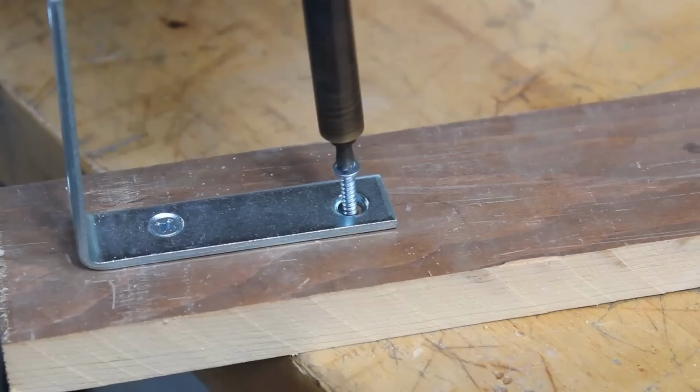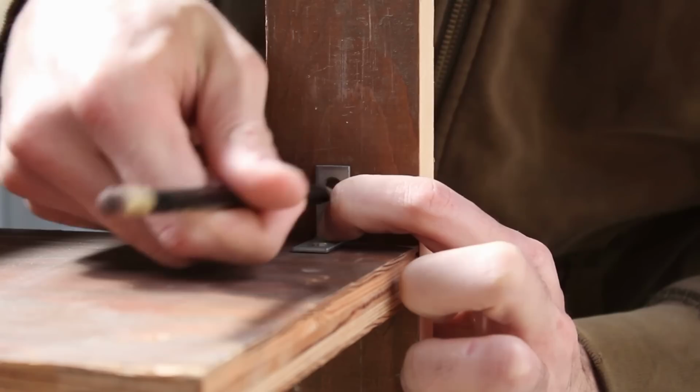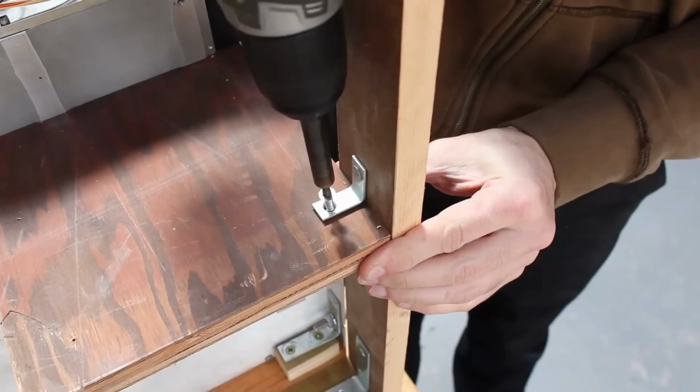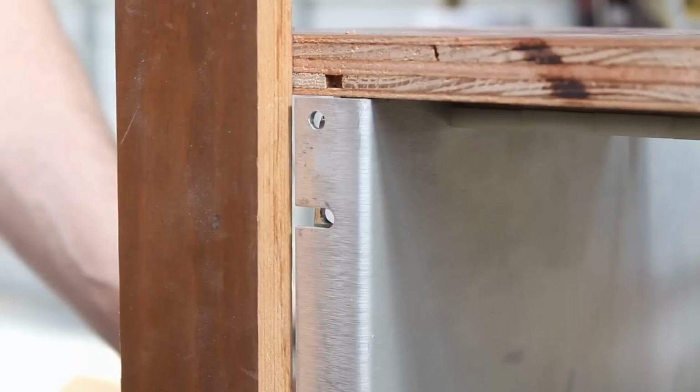So we'll start by getting the side trim pieces mounted to the base plate by mounting some L brackets to them. And then to tie it all together, I'm going to run some smaller L brackets further up that mount the side trim pieces to the drive tray. The drive tray is also going to hold the brackets for the upper card cage mounting bolts. And so I'm just going to cinch those down, and with those tight, it's time to move on to mounting the drive itself.